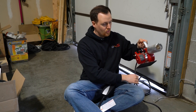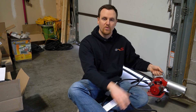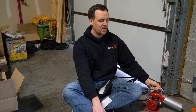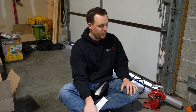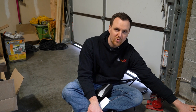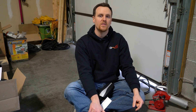If you were to have two of these running from the same duplex set, it would of course trip the 20-amp breaker on there. So that's something you have to keep an eye out for — keep track of how many amps you're using where and when. If you do happen to plug in something extra into that breaker and it does trip, your Tesla will still keep charging because it's not tied to either of those breakers. It's directly connected to the breaker on the 14-50 outlet.